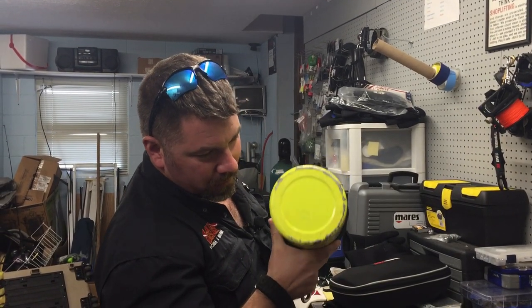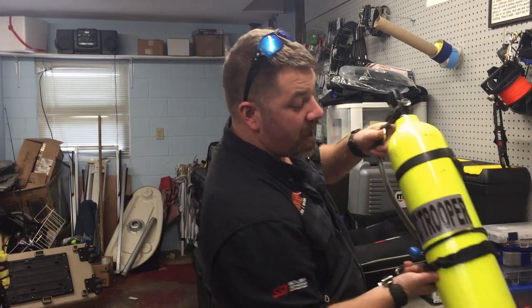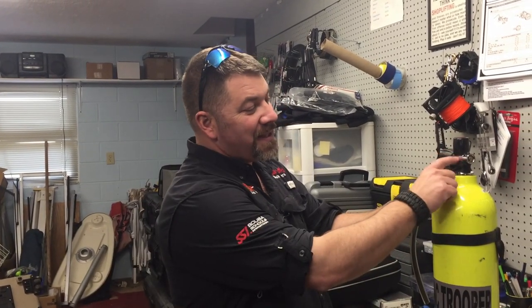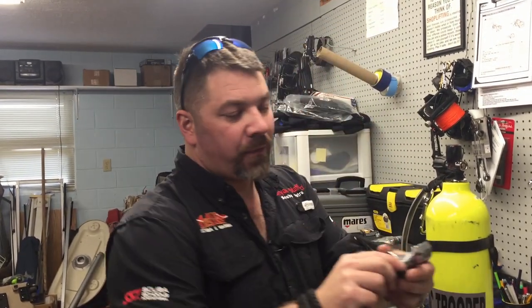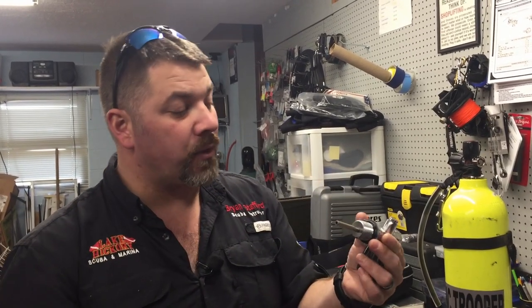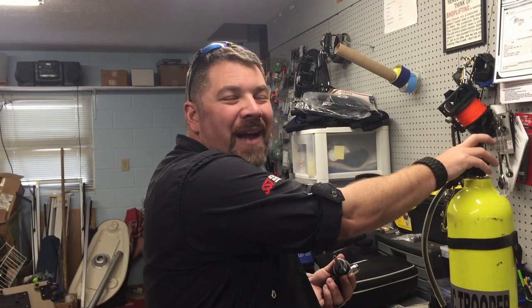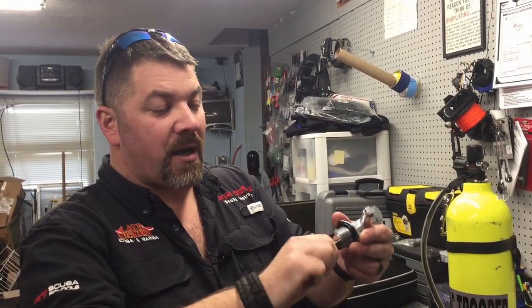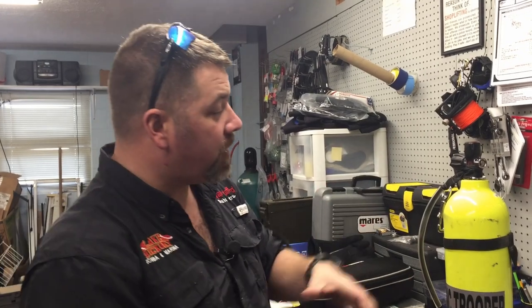Hopefully you guys can hear that. If you have a personal tank or even if you rent a tank, one thing causing that is debris in the cylinder. But it's not something that's going to damage the tank, not something that's actually going to cause it not to breathe properly, and you're definitely not going to breathe whatever that rattling is. What's actually causing it is the dip tube on the bottom of the valve. You'll see this little dip tube - sometimes they're permanently mounted, sometimes they're screwed in depending on how new or old the valve is. Most are screwed in, which I know for a fact this one is because I actually put this cylinder together. But over time, depending on how well you torque that in, those dip tubes can come loose and fall down into the cylinder.